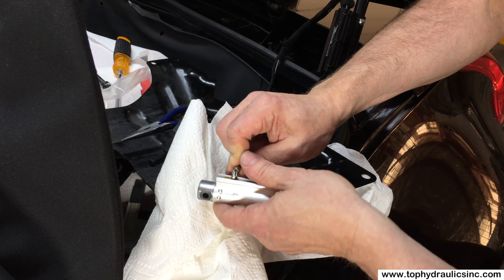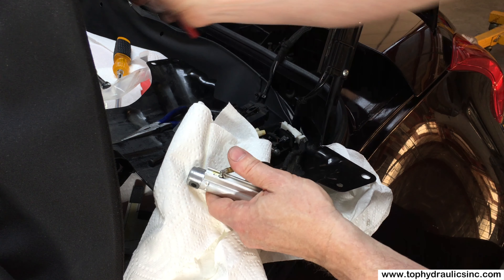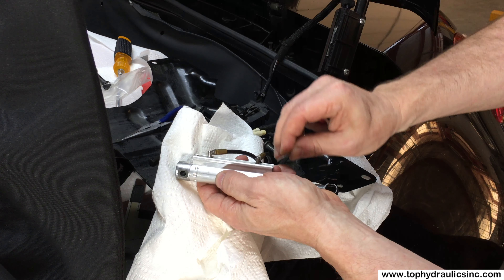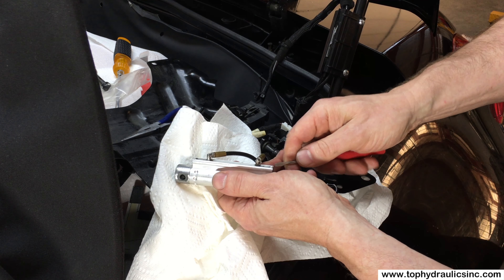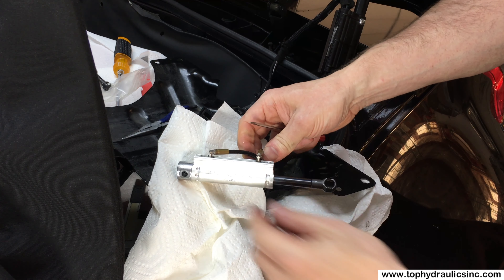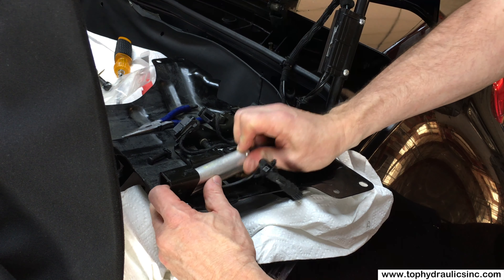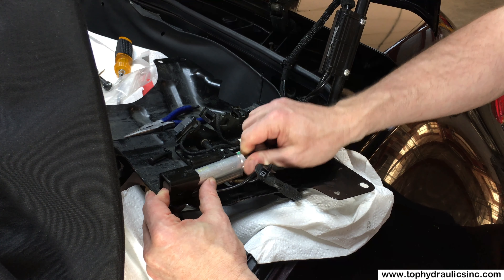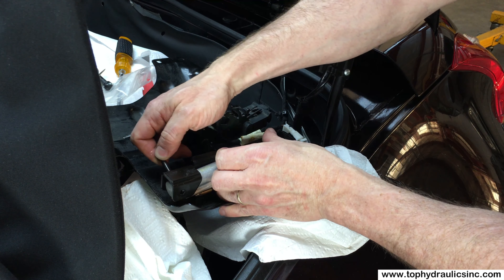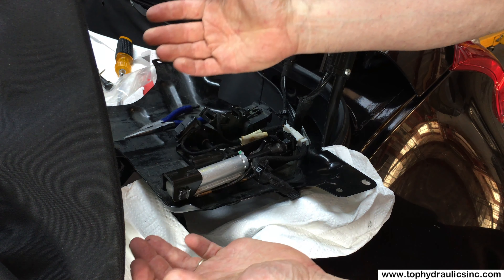Let's stick them in here: 72, push the fitting straight in; 71, push the fitting straight in. Then get the two clips — one, two — and push them back into place. Done — hoses connected. Now put the cylinder back into the rear bushing first, then push the mounting pin through the rear bushing. The clip goes on just like that — safe and secure.